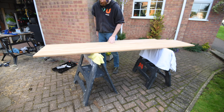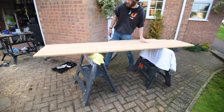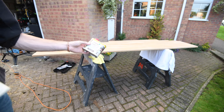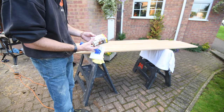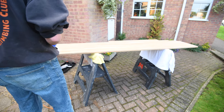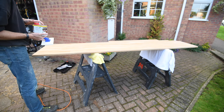I've got to sand the worktop back — it comes with a finish but it's still reasonably rough — so I'm sanding with 240 grit and then applying oil afterwards. I'm using Osmo Top Oil, which is specially designed for wooden kitchen tops. I'm going for the Acacia shade, which makes it slightly darker, applied with a foam fleecy applicator.